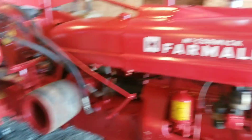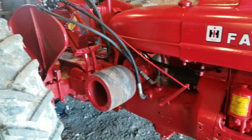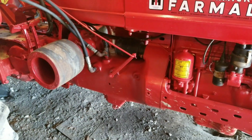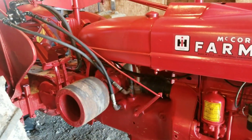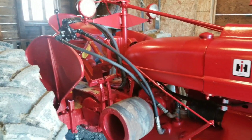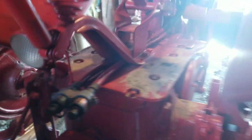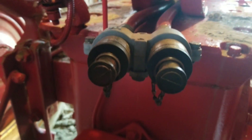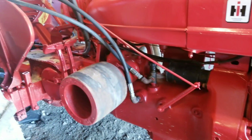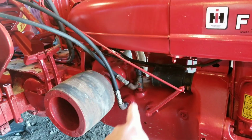I have not flushed this out yet. This is a 1949, and I'm guessing around this timeframe is when they put the new and improved pumps in, where maybe they went to 800 PSI. Again, if you know what year or breaking point that was, please let me know. But this is pretty much how it's set up on the Farmall tractors. You can see the back here is plugged off to keep dirt out — you don't want dirt in your pump. Whoever set this up decided everything was going to be one stop shop on this same side.